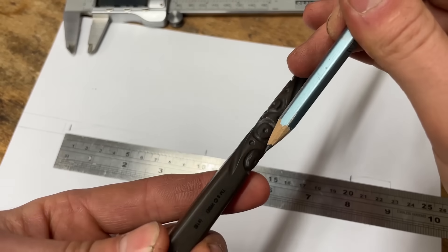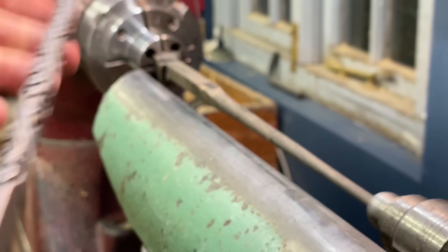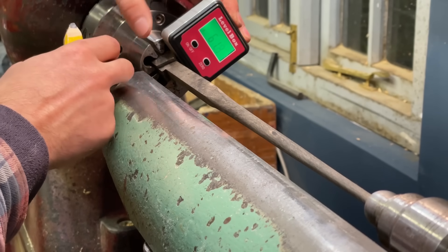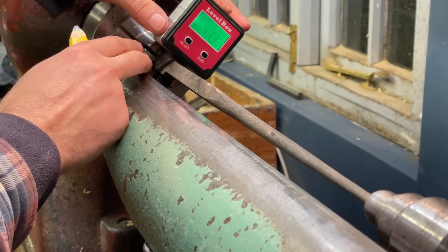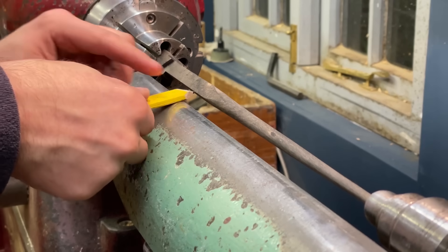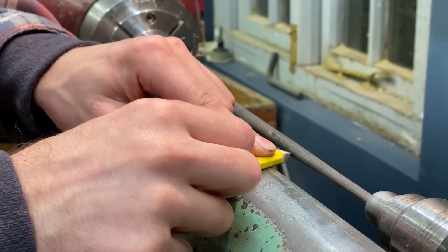The circular markings also follow the spirals so there are actually four spirals to mark out. It's a bit hard to see where the spirals start but one of the circles starts in the corner so I'll use that as my reference point. The indexing ring on my lathe doesn't line up with my chuck, so the easiest way is to utilise the square sides and my digital level box. The pencil I have has been planed down on one side so that when it's rested on the flat section of my tool rest it marks the centre line. Once set to 45 degrees I can then run the pencil down the shaft. Even if you're slightly off, if you keep the method the same this will reduce systematic errors.